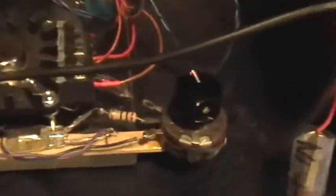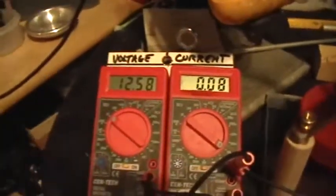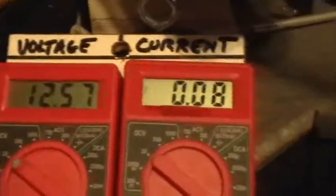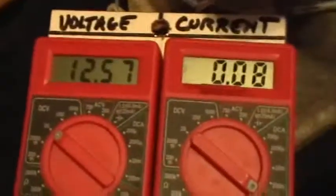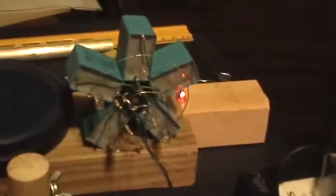You're supposed to be able to tune this pot for the sweet spot of the performance. I'm running on battery B1. It started out at 12.61 volts and now it's down. It's going to take a long time for that battery to run down. I want to run it down to 11 volts before I swap it, but I may just run it to 12 volts because it's going to take hours. It's a 5 amp hour battery and we're only drawing 70 to 80 milliamps right now. We are actually running the ring oscillator as a load.